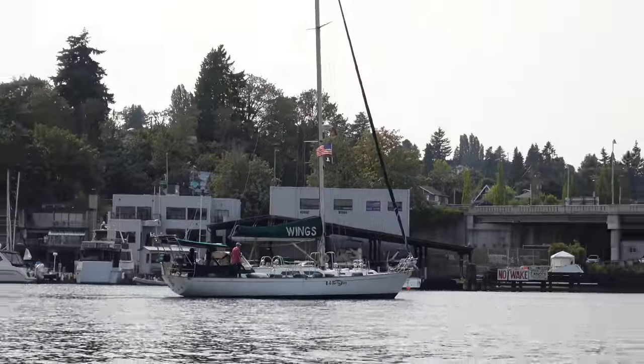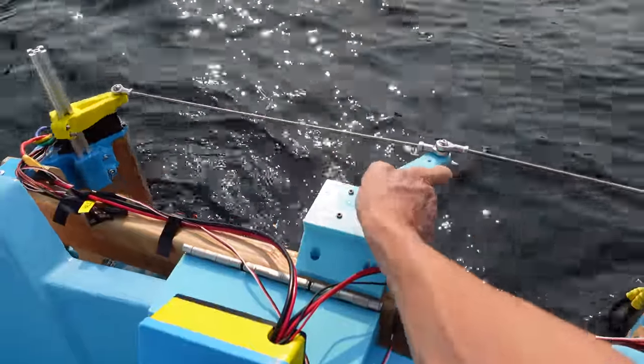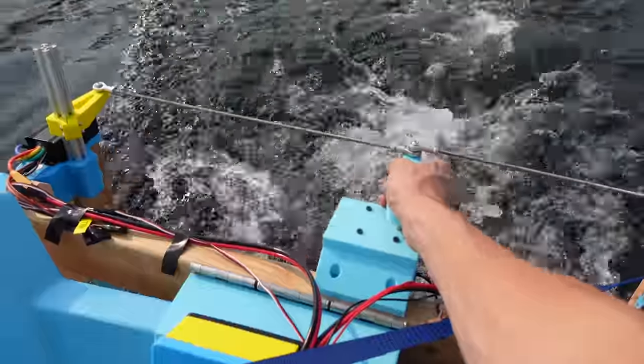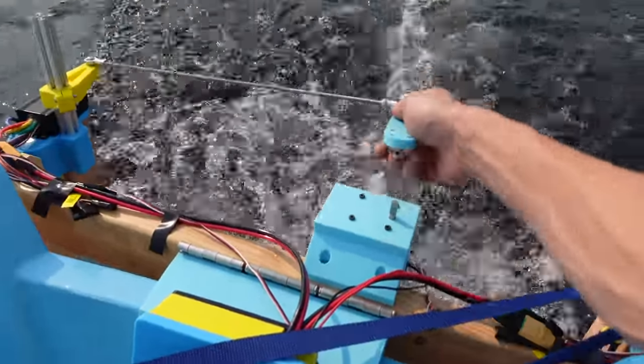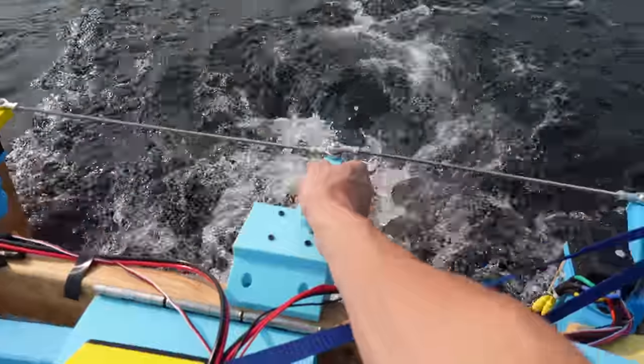It's for that sailboat that needs to get through. Oh my God, this servo stripped already. Look at that. That was a beefy servo, I can't believe it. Now I'm just driving at home manually by moving this, but I just realized that it wasn't the gears that stripped. It was just the hub came off of the shaft. The set screw came out, so I gotta re-secure that.